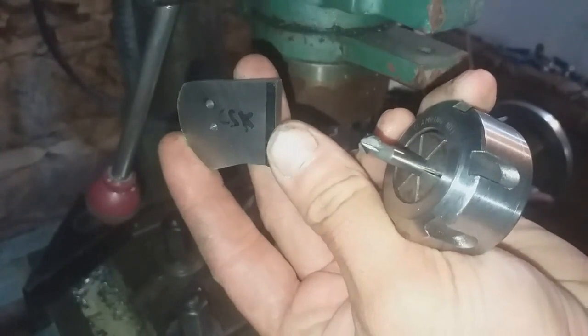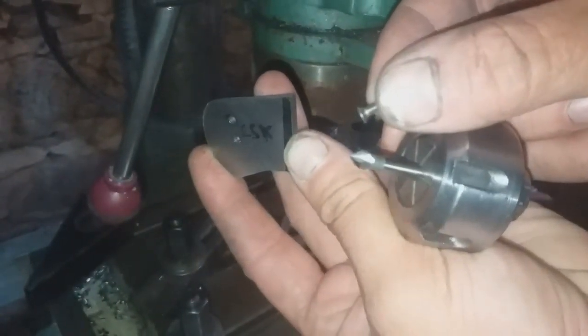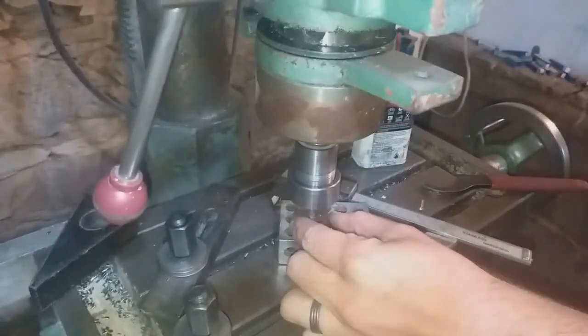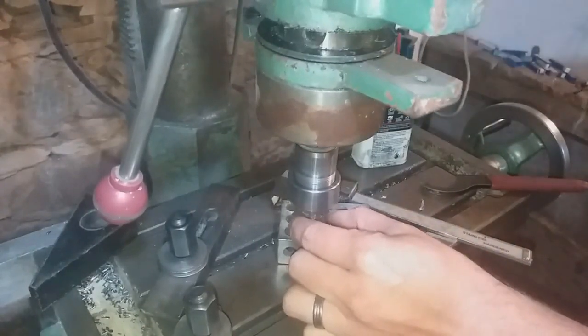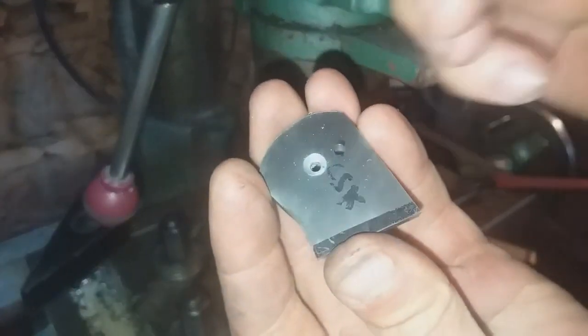I added a couple of countersunk holes onto the bolster that's got an angle on them that's identical to the M3 screws I'm going to use to assemble. All of this had to be done because I was going to heat treat the bolster as well. That's particularly important because, again, in order to get the same patterning on the Damascus and in order to enhance corrosion resistance, all this steel needs to be heat treated.